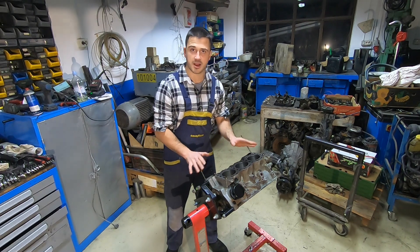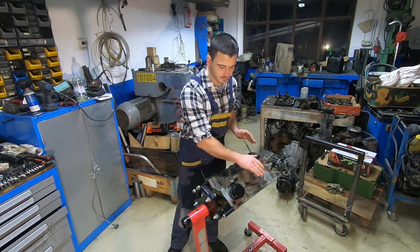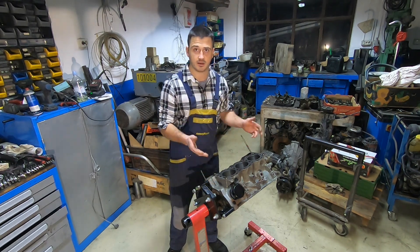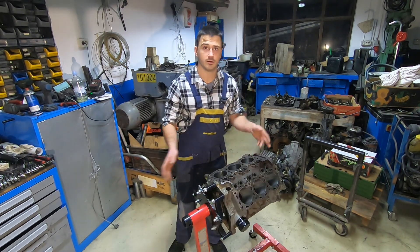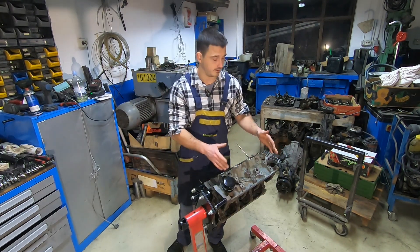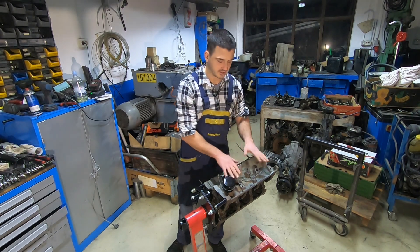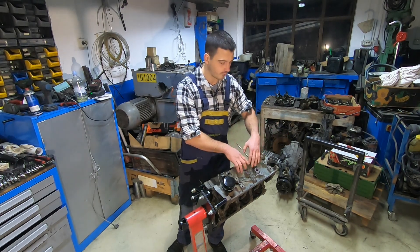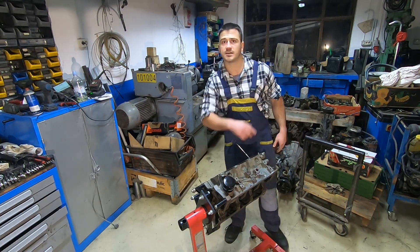Once everything is masked off and protected, we will attempt to remove all the dirt and paint, and also grind off some sharp edges that were left over from the casting process and aren't really structural or functional at all. Then we will use the wire wheel on every place we can get to, to clean off the dirt and paint. And then we will actually use a propane torch in order to heat up the casting locally, to let any possible dirt or oils get out from this porous material. So that's it — let's get to work.